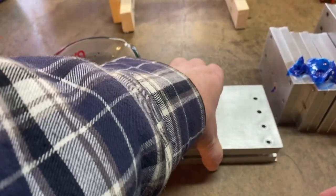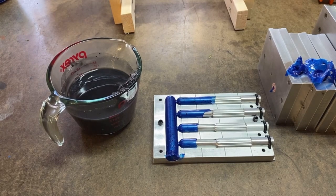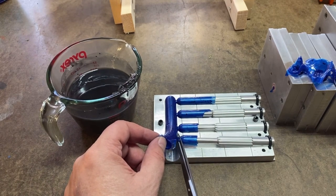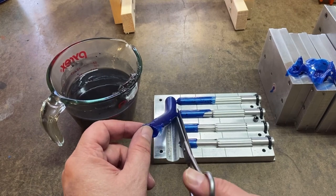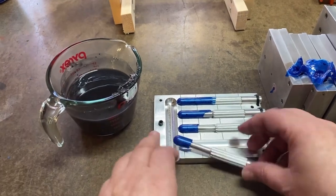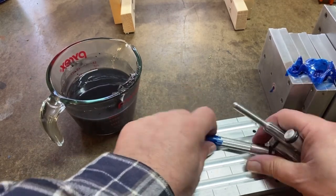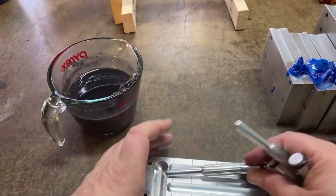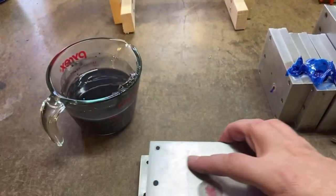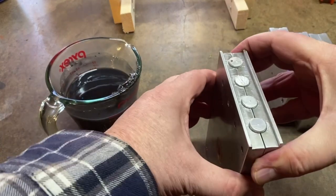Nice and gentle. There's the tubes. Oh, and this one didn't fill — sure didn't. Look at that. This was that last one I said I wasn't sure filled all the way, and it sure as heck didn't. Not enough plastisol. These aren't even worth saving. My injector wasn't quite full. I figured it should be enough, and obviously I figured wrong.